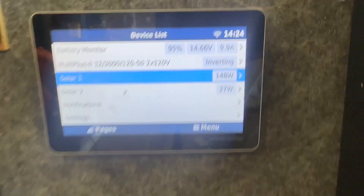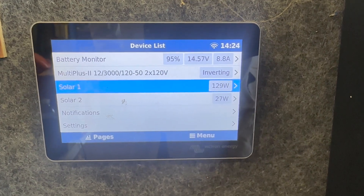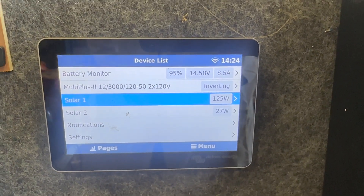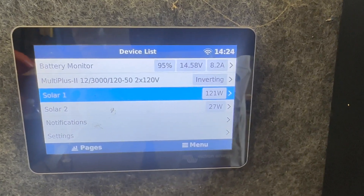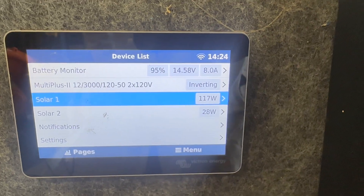The reason why the watts are going down is because the battery has reached absorption voltage, so amps are being limited — but I didn't realize that at the time. I'm estimating that busted-up panel gets about 15 percent or so.